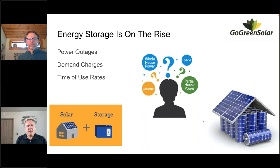If you've got a battery bank set up, you could be pulling 9,000 watts from the grid and pulling the other 5,000 to 6,000 watts from batteries to keep yourself from being charged more. The same is true for time-of-use rates — where power is more expensive from 4 p.m. until 10 p.m. You can use batteries to power loads during those critical times so you're not using grid power when they're charging a premium for it.